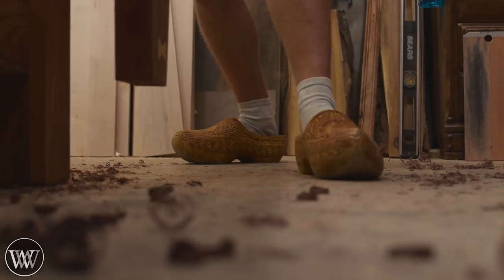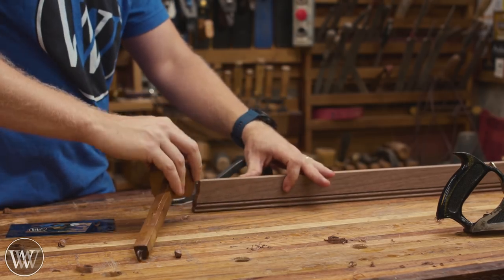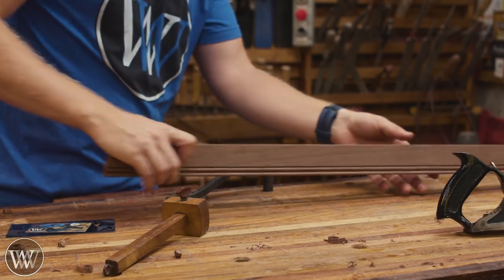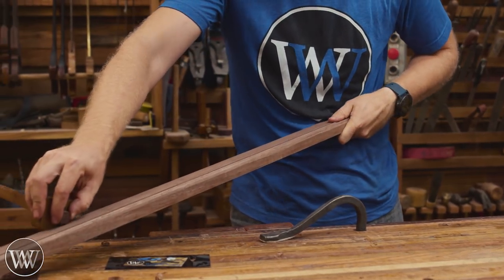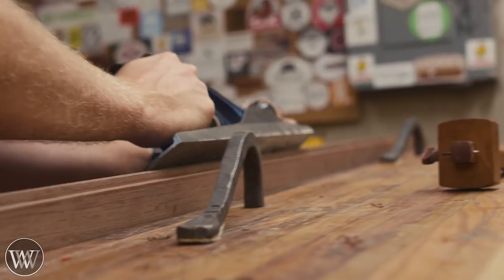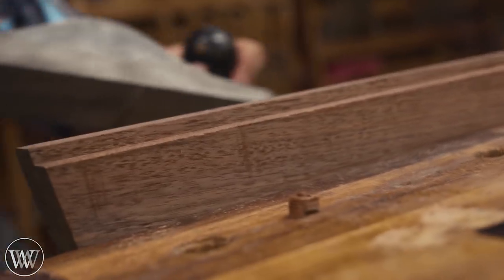I like hand tool woodworking, especially with walnut. Once I have that rabbet created on one corner, I can go back to the other corner on the front face and put in a chamfer. I'm going to be putting a 45-degree chamfer that comes in a quarter inch and then down a quarter inch. I'm going to use a marking gauge to mark off lines at a quarter inch in and a quarter inch down.